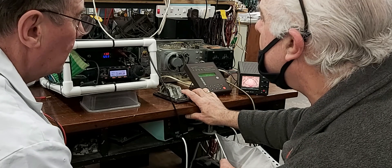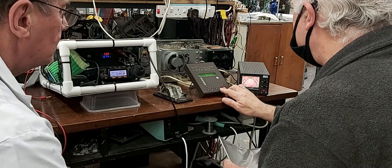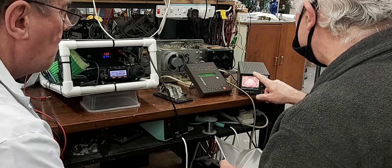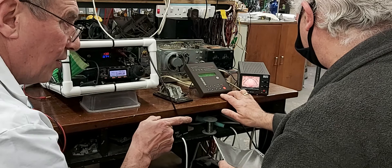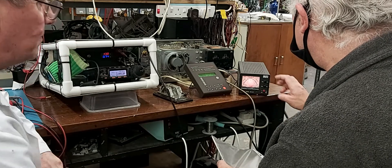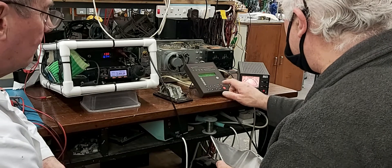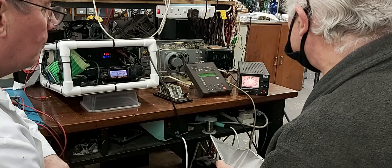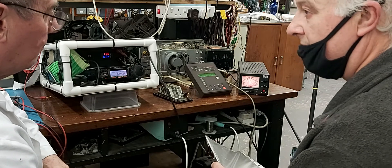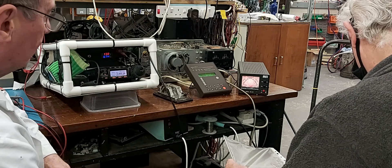That's 10 watts, yeah? It's not keyed in. Hang on — it's not keyed. So it's in bypass. It's seeing it — that's the first thing. So, operate. So it saw the output at 10 watts? No, it's seeing it all the way through directly. And I'm pressed to operate, so it should go into it. No, it's not. It's just not. It's not even keying the transmitter out. So it's not sniffing the RF input.